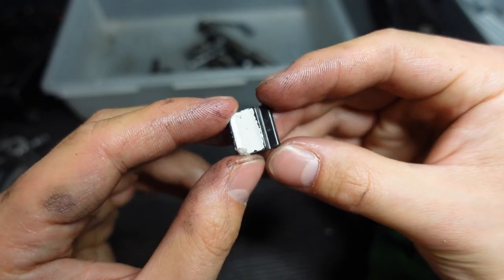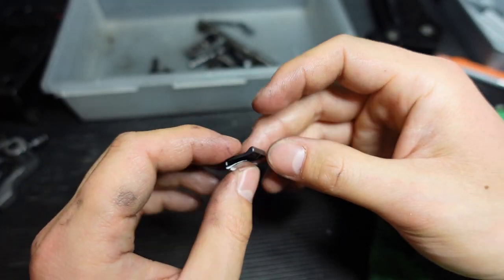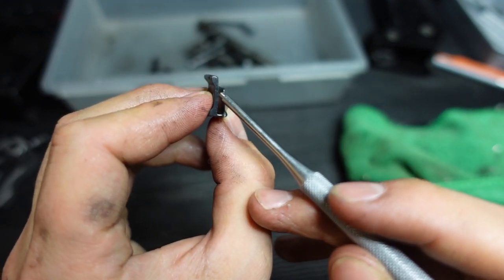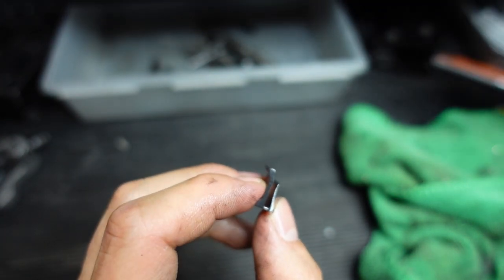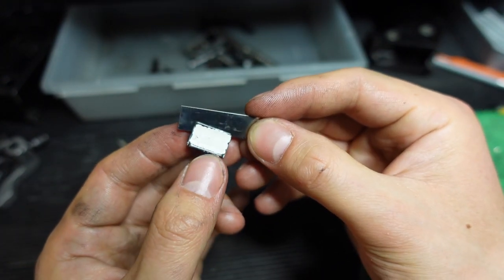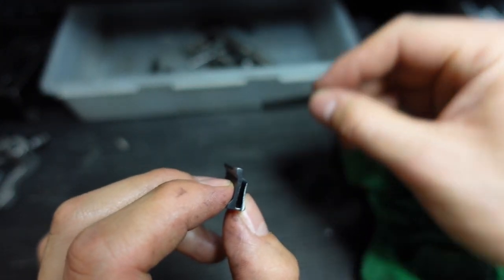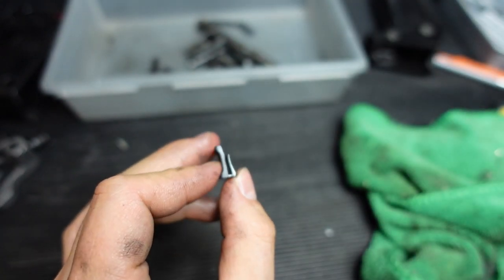So now that we have the full auto blocking plate wiped clean, let's give it a test. The space between that lobe right here, the clamping space, should be between 1.25 to 1.4. So let's try with a 1.4 gauge block. You can see, ooh, that is a pretty sloppy fit right here. So I'm just going to tighten this real quick and see if we can correct that.